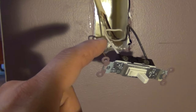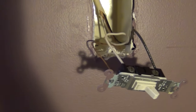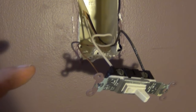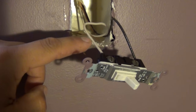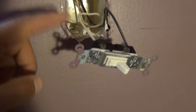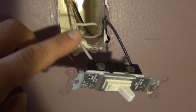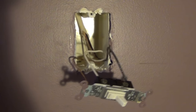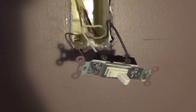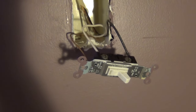Even though you see a white wire in this box right now, that white wire isn't a neutral. Technically speaking, it was a poor job by the electrician because he was required by code to indicate this is no longer a neutral by putting a black piece of electrical tape on it or some type of label. Someone without electrical knowledge could come in and think this is a neutral, when in fact it could be 120 volts present on it. So you always want to do that — if you're using any conductors other than black as hots, you have to indicate that with tape or a label.